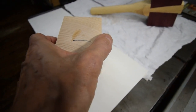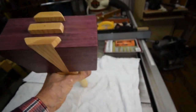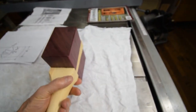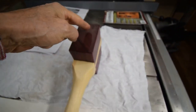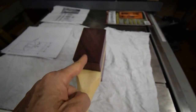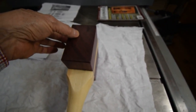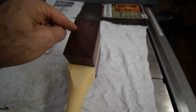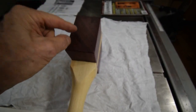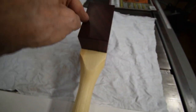And anything you can do to make your life easier, you're better off doing. Now, the two undercuts you make in your tenons, to be able to squeeze it, you saw that we cut two undercuts. I used a see-through plastic French curve. I found the curve I wanted, put it on top of the tenon, put a piece of tape to mark its location, and then traced it.